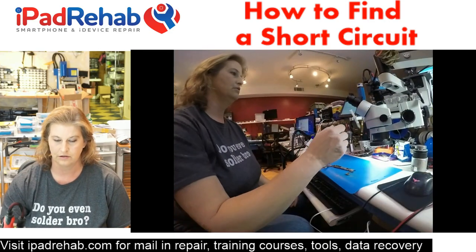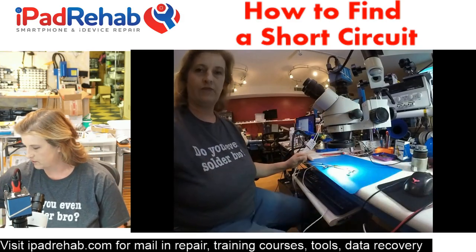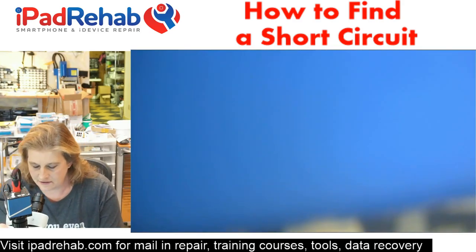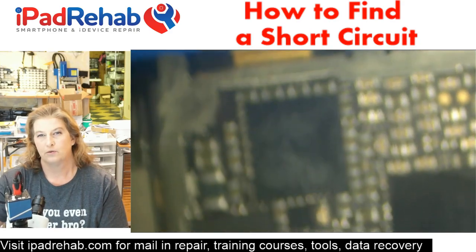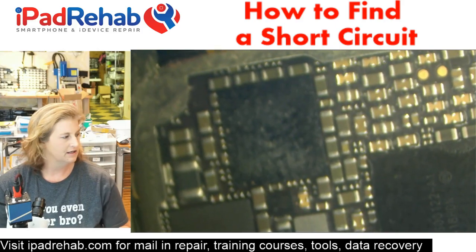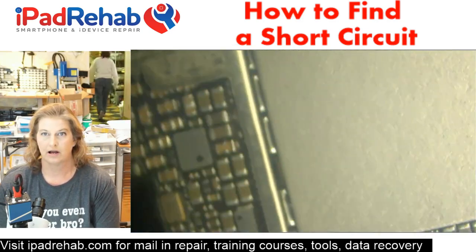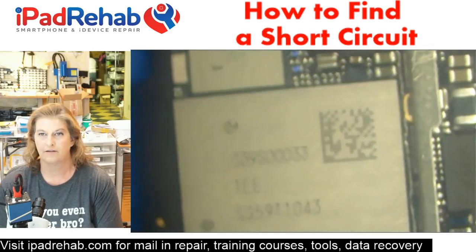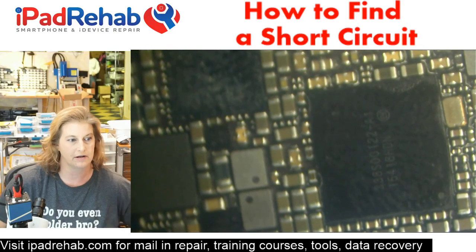All right, let's go to the freeze spray method. For the freeze spray method, we are going to switch over to microscope view. With the microscope view, we could take a tour of the whole board, but let's just stick in this view where we think that there's a short somewhere around here. Maybe up here, maybe by Wi-Fi, but we're going to look at the PMIC itself. All right, so let's do that one.